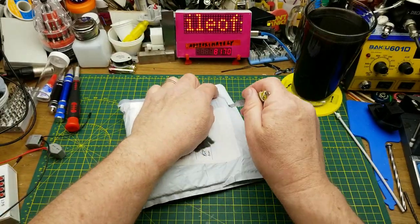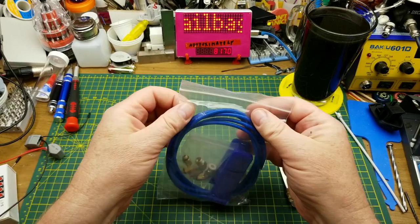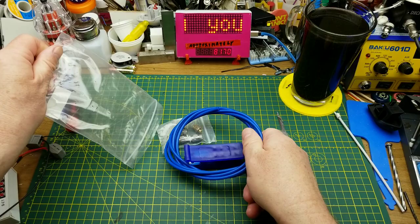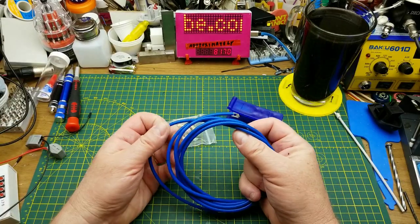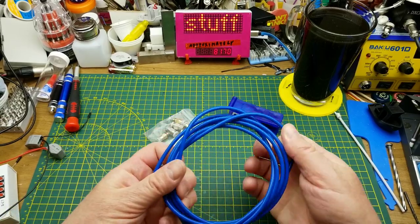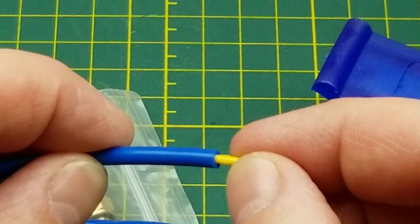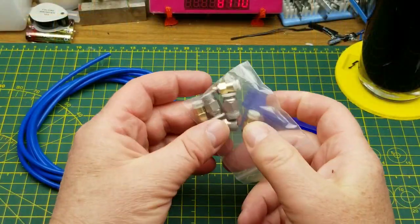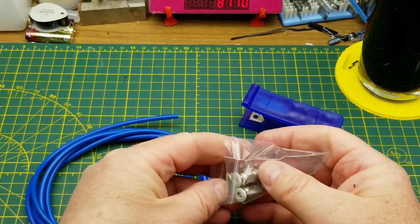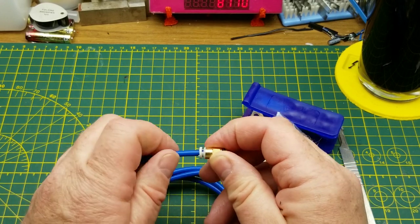This one calls itself 'tubing.' Well packed — this is some PTFE tubing, aka Teflon, aka Bowden tube from a 3D printer. You may recall a while ago I bought some cheap knockoff stuff that was the wrong size. So now I have got this little set — this is the actual tubing, and I have a piece of filament here. It fits nice in there and it has a little bit of slop in it, but not too much. It's a little bit tighter than the stock tube, which I think is good. This one came with fittings for both ends so I don't have to worry about not matching the physical size of the existing ones.